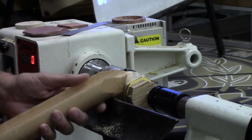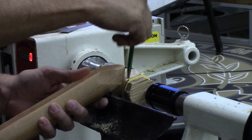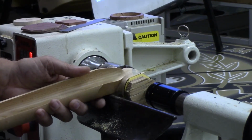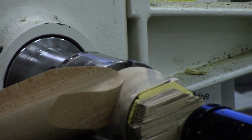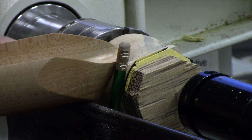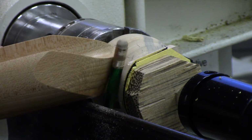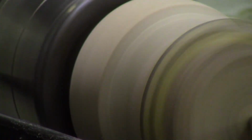If you're doing a very shallow cut, almost nothing cut, yeah, you can have it turned kind of over on its side. But remember, that cut is from here over to here. You may be rubbing the bevel on the point, but all this, if you're over here, is not a bevel rubbing cut. It will cut a lot better, a lot faster, a lot smoother, and your tool will stay sharp longer. There's such a fine line of being on your bevel and being off of it. That's just one thing you need to understand. When you're on that cut, the cut is so fast, you have to try and keep up with it. If you're over too much, you're doing a scraping cut.